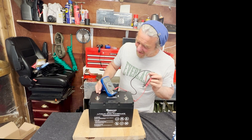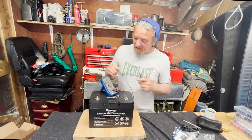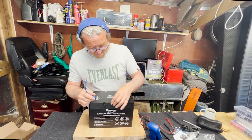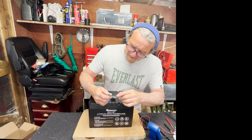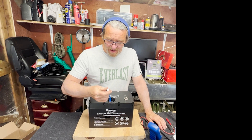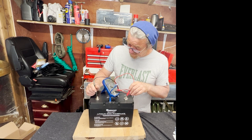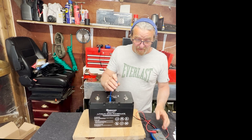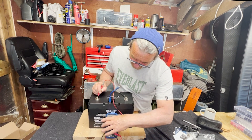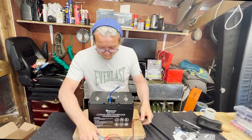Let's check the battery bank — it's arrived reading 5.88 volts, which is an inactive dormant battery. I'm going to plug in the uplink and hold the button for three seconds. The light has gone bright blue and now it's running at 13.24 volts — pretty good. Now I'll hold the button again to deactivate it, and it's dropped to just under three volts — back in dormant mode. Happy days.